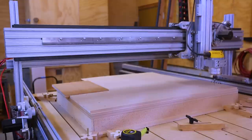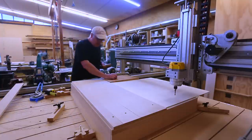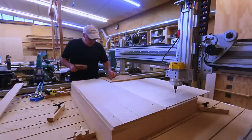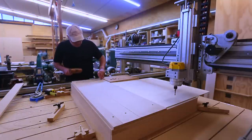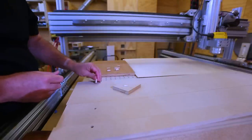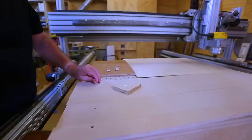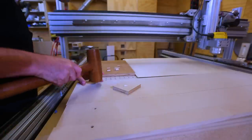What I came up with was to combine the peg idea with those flat dam pieces, so when I put a flat piece on it'll be nice and square to the router. I can make a quick jig as I'm setting up a piece, because the pins just hold the pieces of wood square to the router. I put pins in those boards — for now just in the long pieces that run the width of the table, but I may do this with the side pieces as well.